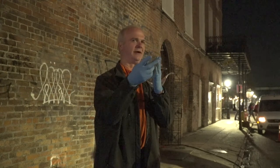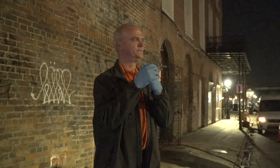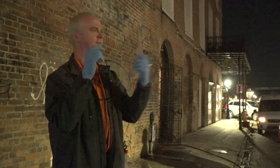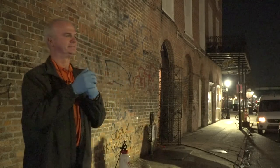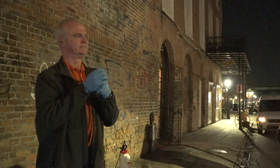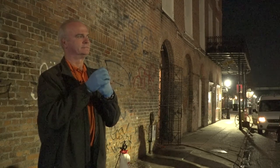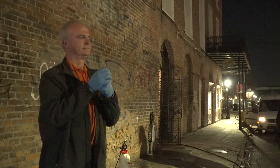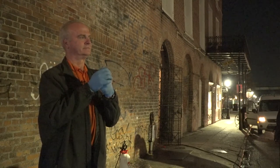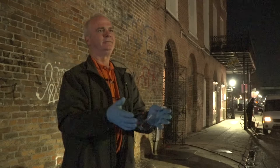It's kind of like a 2-hour rain versus a 1-hour rain. That one application, you're just getting basic wet in. So the first coat wets in the surface. So that coverage rate is those two. If you're doing a water repellent that's a water carry, you would pre-wet the surface to break that tension, which would open up the pores and drive the sealer deep inside, because most of them are penetrating, not film forming, where these are film forming surfaces. So you got to break the natural tension of the brick to allow that clear repellent to sit inward, so you get a good adhesion. So that coverage rate is based on, the first one may go on, because it's a hot, dry surface, it may go on at 50. The second one will probably go on at 100.